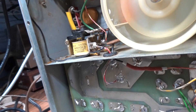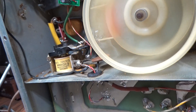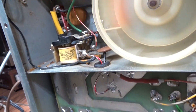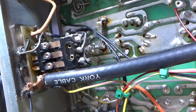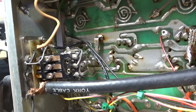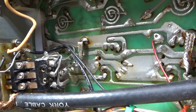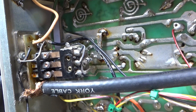I'm not sure I like high voltage being switched to the tubes like that. I've seen other amps like the Nitro 300A where the high voltage was in the main relay using the center tap, and the high voltage arced and took out someone's radio. On this one, the center relay keys a separate relay with only 12 volts going through it, and that relay then keys the high voltage — so the high voltage is safely far away from your radio and input relay.